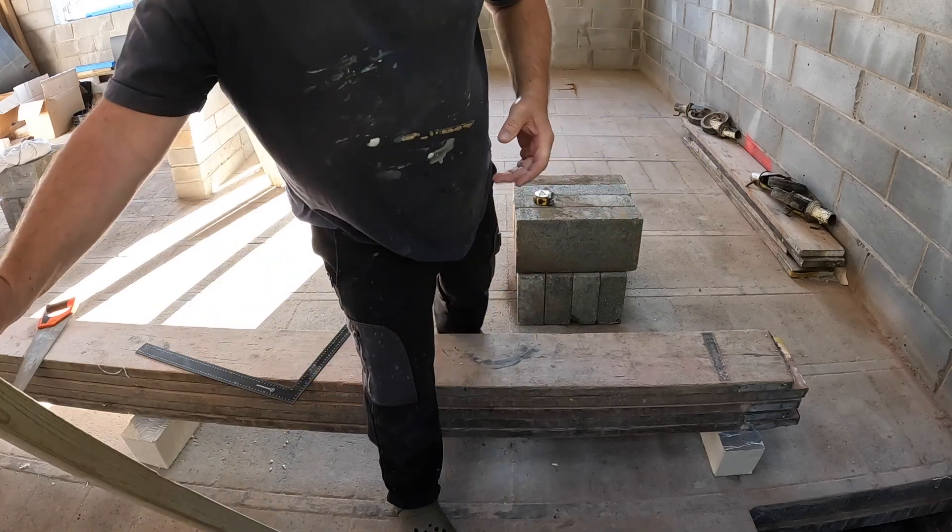I'm going to do exactly the same thing on the other two pieces of timber. So I've got my three pieces of wood with a pencil mark on at 58 inches. I now need three pieces of wood somewhere around a foot to two foot long. Two things are important: these cross-pieces must be squared off that pencil mark because you're making a letter T. It's important it's square and it's important they are all the same height from the floor — if you get that wrong your boning rods will work but your excavation will be wrong.